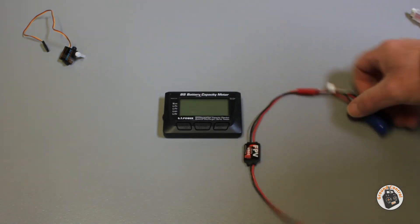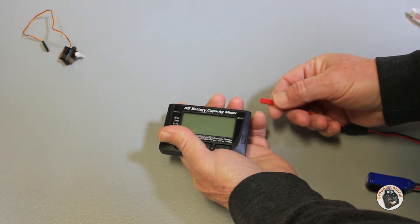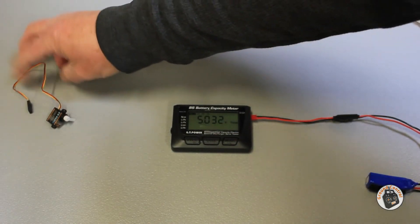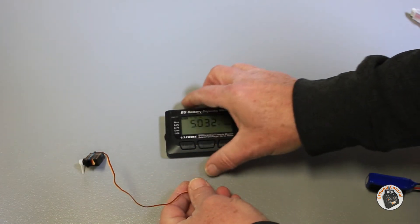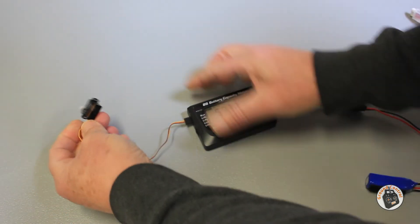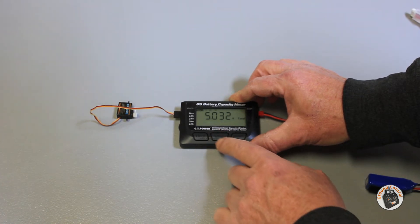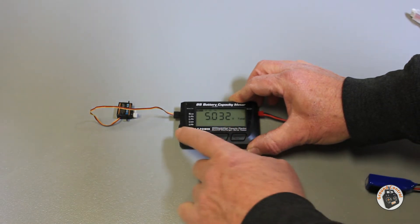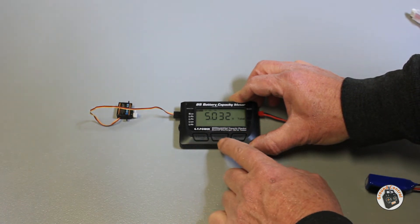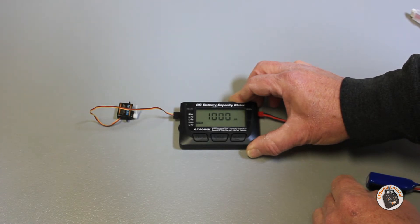I've got my two-cell pack hooked up to my voltage regulator. On the side, it shows you the plus, minus, and signal wire locations, so make sure you get it plugged in the right way. That red JST connector fits right over those pins. On the servo connector port, it shows where the signal, plus, and minus wires should be connected. The center button says 'cell' and below it says 'servo' — large print labels are quick-click, and smaller labels at the bottom are long-click.